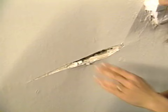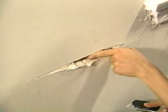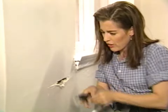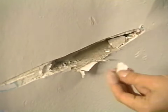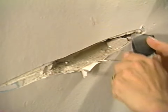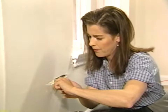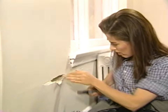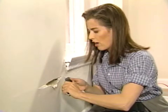See what's happening here? There's plaster, which is white, over a coating of cement-like brownie stuff. And I'm going to make this crack really big so that there's no chance of it recurring. It's really like sand that comes out. I'm going to take it back a little bit further because the wall is still kind of punky and soft here.